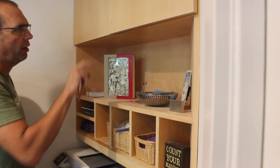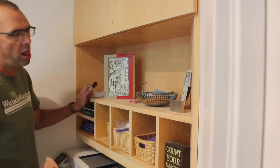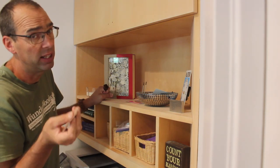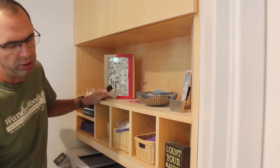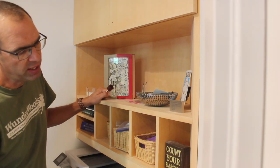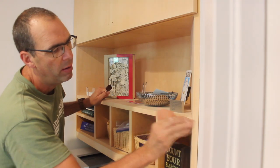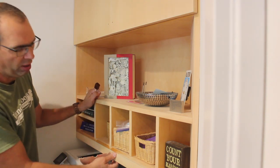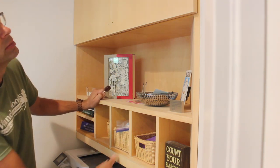I've moved on to sanding back here in the corner in this little nook. I've worked on the doors already and sanded some of these with the disc sander — you can see my sucker — but I've also been doing a lot of hand sanding. These little veneer edges you can easily plow through and bend the edge over when you're sanding with the orbital sander, so these have been taking a lot of little hand sanding, right like that, so I can control it. Pretty tedious but they're coming up pretty nice and light.